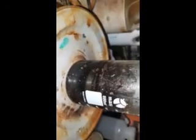It's getting late now outside, so I'm just going to turn it off. And if there is any gold left in there, that extra little bit of nitric I just did will work. Tomorrow I'll filter it and denox it. I don't want to denox it while there's all that paper pulp in there. I'll filter it first, then denox it, and then drop the gold tomorrow.